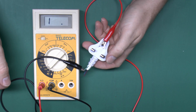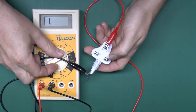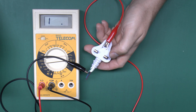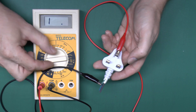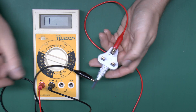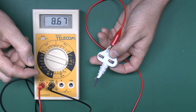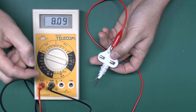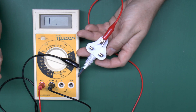Well, apparently not — it's just open circuit, so it was a bust after all. Let's try a higher range and see what we get. Absolutely nothing. So as the meter implied originally, it is in fact totally open circuit. Even on the 20 megohm range there's nothing at all. If I touch the probes with my fingers it registers several megohms, so this is obviously completely unconnected inside the plug.